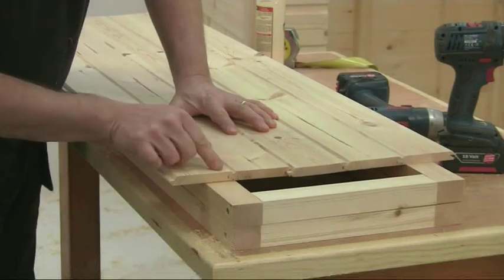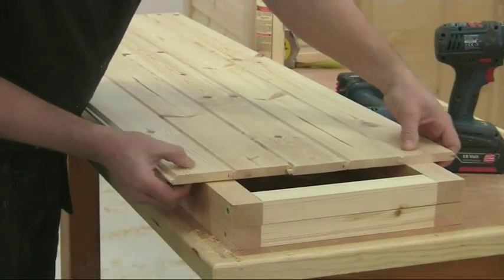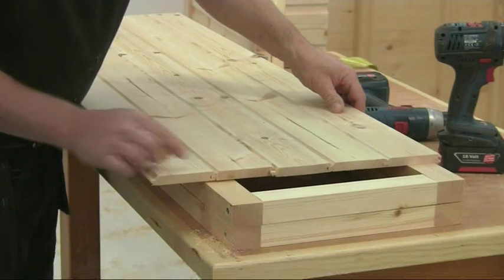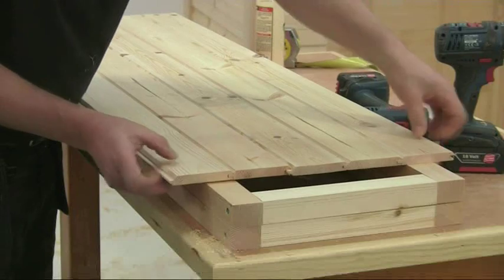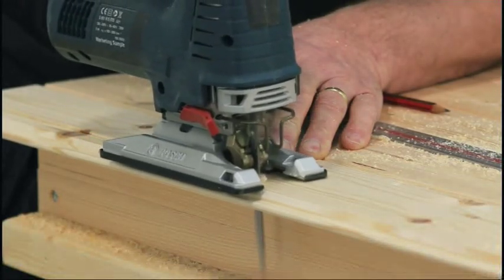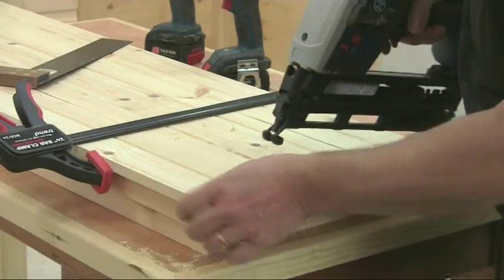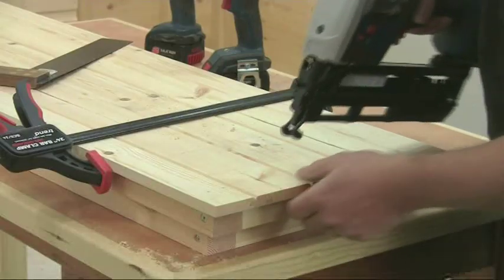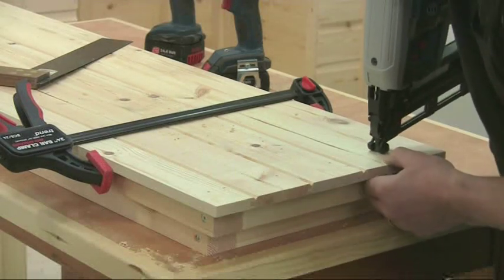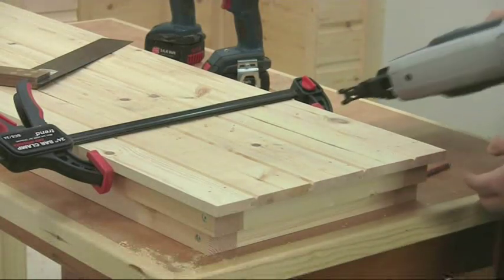This is standard tongue and groove material which slots together much the same way as the ship lap. I've actually got to use five pieces to get the width of one door, and although I want some overhang I don't want too much, so I'm going to trim a bit off both edges to centralize it rather than cut it all off one edge. I think it's safer to use the jigsaw for these narrow pieces rather than a circular saw. Once the pieces are the correct length, I nail them onto the framework using a nail gun - a couple of nails in the narrow pieces and one nail in each of the wider pieces, to allow for some movement during the warmer months. I use a clamp to pull the joints up tight while nailing.